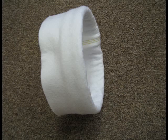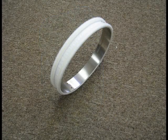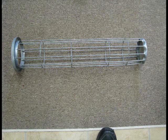This is a picture of a snap band before it's installed on a bag. Inside the cover is a metal band with polyester beading over it. Notice the polyester material is folded over in such a way that it creates a groove that fits in the tube sheet of the bag house. This is a picture of a top load cage, which slides down inside the bag to help support the filter.